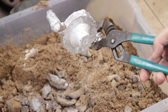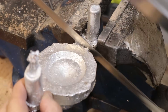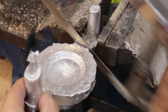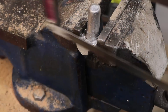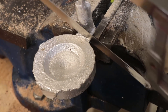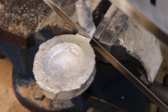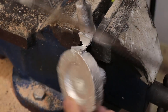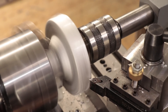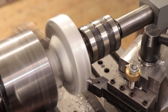There is some shrinkage in the centre and that's no real surprise — aluminium does shrink a fair amount as it cools. However, this could have been avoided by having a feeder or just moving around the riser. I did this for subsequent casts and it did for the most part reduce most of the shrinkage issues. A lot of this just comes down to having skill and experience, and that's just not something I have yet.